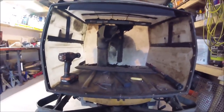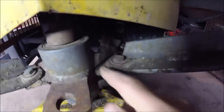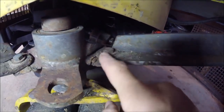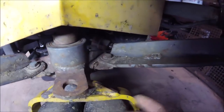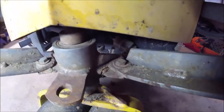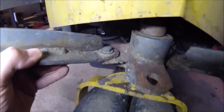So that helped it out a little bit, but not as much as I would like. It turns out I have a bigger problem. If you see down there — look at this — there are supposed to be tabs that come out here, and then the framing for this dump bolts through there on both sides. Both these tabs are broke off, and it looks like somebody half-assed tried to weld them at one time. I noticed a little crack in there about a year ago and spot-welded the other side, but it turns out the whole thing was cracked, which is making this whole back end move.